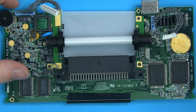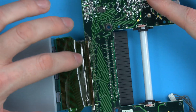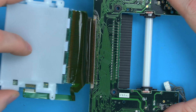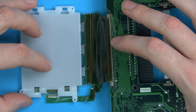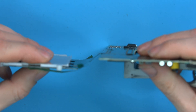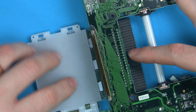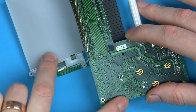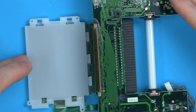The first step is to remove the LCD. I'll show you the way I do it that allows you to remove this completely clean without ripping pads, without burning anything, and with a completely reusable screen. The trick is, when it's loose here, you want to tuck it under so it gets a sort of a fold. What's going to try and happen is this here is going to try and lift up naturally. So just push in like this and hold it in position to keep it under a bit of tension, otherwise it will just spring out.